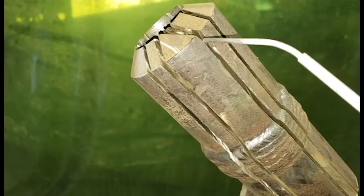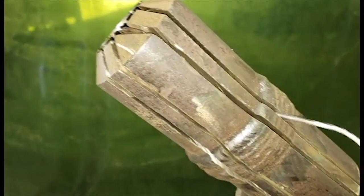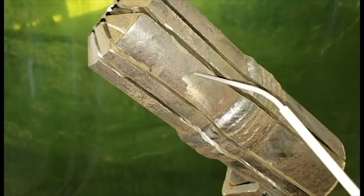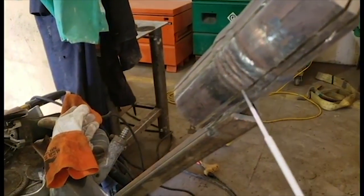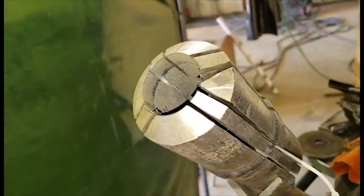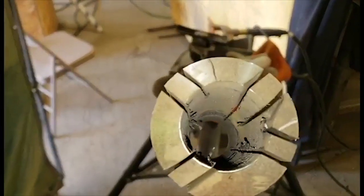Here's the 6G Super Coupon test. What I'm doing is showing you that I made my cuts parallel to the chalk lines I made. This particular strap has to be three-eighths of an inch. You want to make sure that you leave a little metal intact at the bottom so that strap won't fall all the way through. It's important that you hold that grinder parallel to your cut and cut straight down, following that chalk line to the best of your ability.